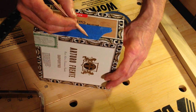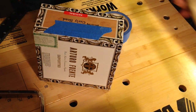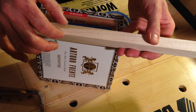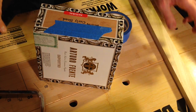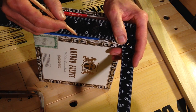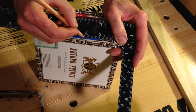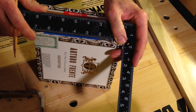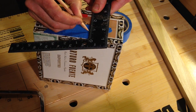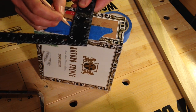And then the next thing I want to do is measure out the notch where I'm going to cut for the neck. As we know, this piece of wood is one and a half inches in this direction, three quarters of an inch in this direction. So I'm going to measure out three quarters of an inch on either side of the center point on this box, as that would be an inch and a half in total. And then I'm going to measure down three quarters of an inch.